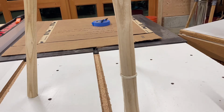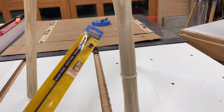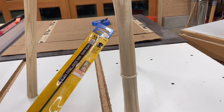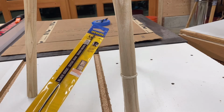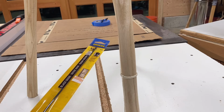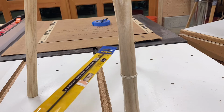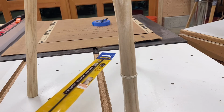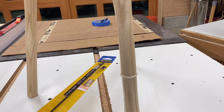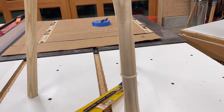Right now I have on order a much longer bit, but my only long bit right now is 1/8 of an inch, and I was recommending 1/4 of an inch as your pilot hole. So feel free to improvise with what you've got. So I'll do the pilot hole with this guy, and then we'll jump up to the 1/4 of an inch pilot hole so I can get my tapered reamer in the hole.